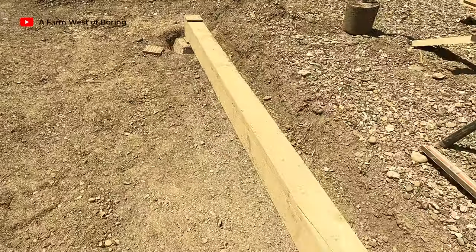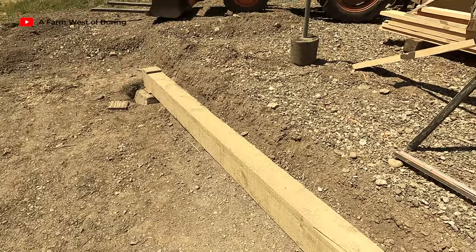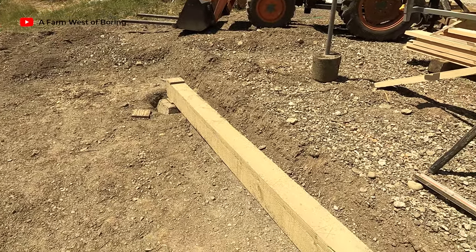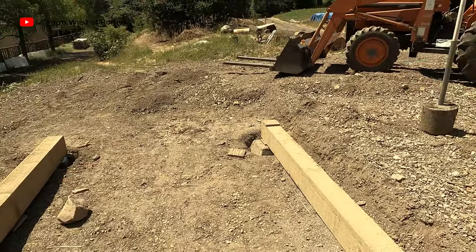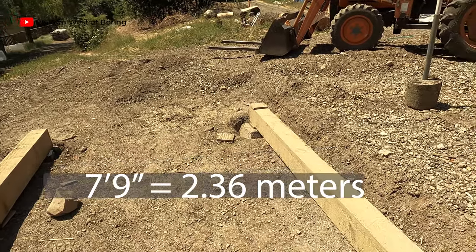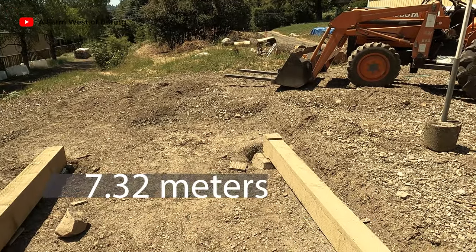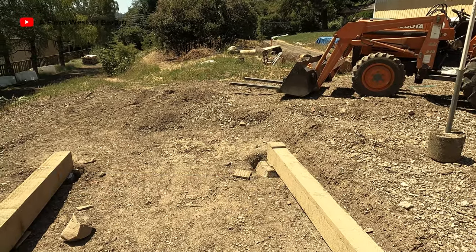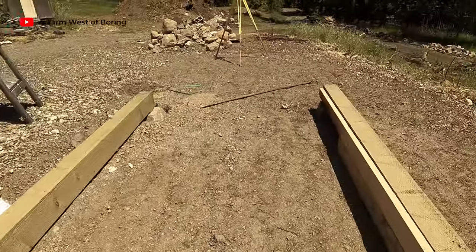So now we have to cut some 2x6s at 7.5 feet long. No, 7.5 feet long, and they'll go from side to side with a rim joist on the outside of each one, so that'll make it 7'9". The rim joist will be outside of the beam, and from end to end it'll be exactly 24 feet long, outside of joist to outside of joist, 24 feet, so our plywood will lay out right. And I guess that's it.